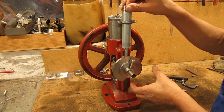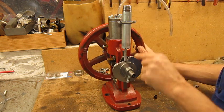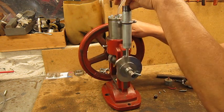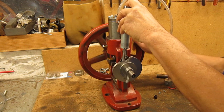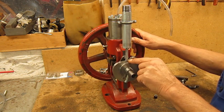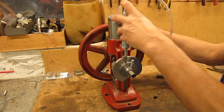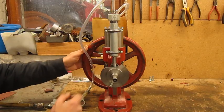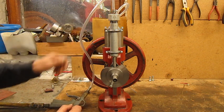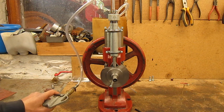Problem number two: when it spins, this angle is too steep, and then you always have this valve clucking down. So I'm going to take this one off and round it a bit more — that will be better. It's just that I have to cut out a little bit more material here so that the valve will stay open a little bit longer. Let's give it a go.